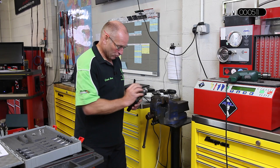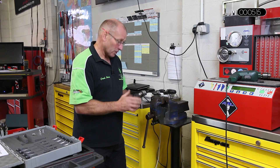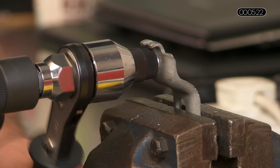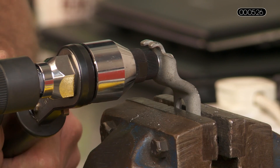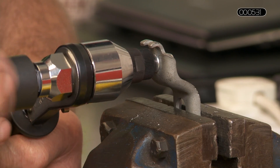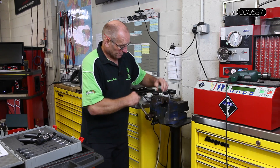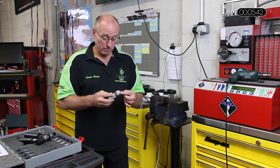Take a look at how secure it is. Try the bolt in. If you feel you need to tighten it some more, reattach the mandrel snugly up to the flange, reverse the ratchet, and tighten a little more. Slacken it off, and you can see it's a very simple tool to use. The net result is an extremely professional, strong and durable fitting.